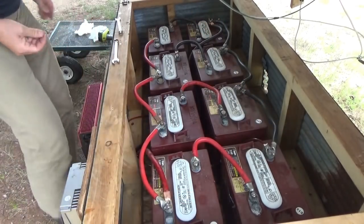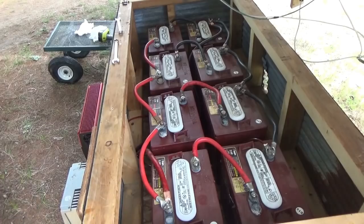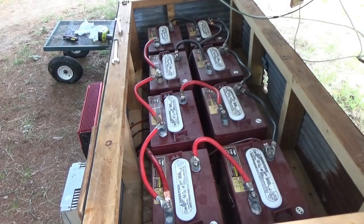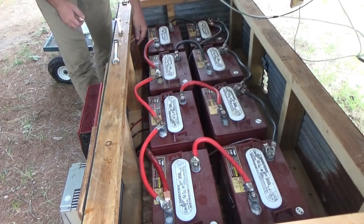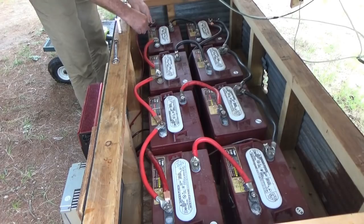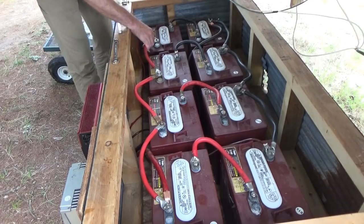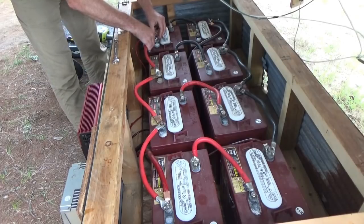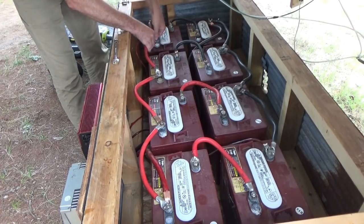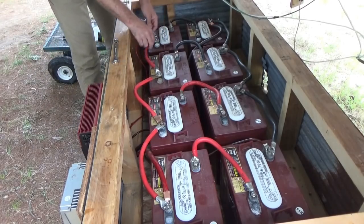The positive goes over here. I'm going to do that after I put the wires in the charge controller, so I'm going to screw them in next. I put the wires in the charge controller — I'll show you that in a minute. I just wanted to not have any loose wires hanging when I put this on here, because then we're going to have a lot of power. Didn't expect that to spark — I know inverters spark, but I didn't expect the charge controller to.